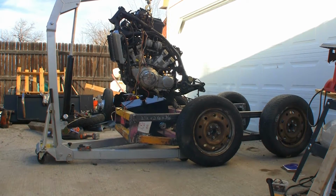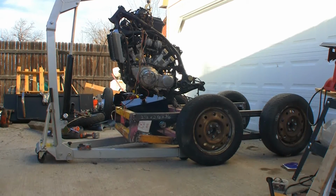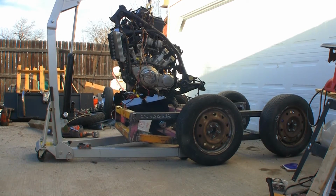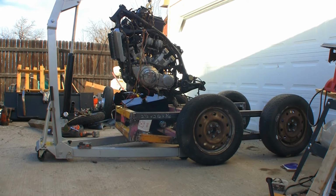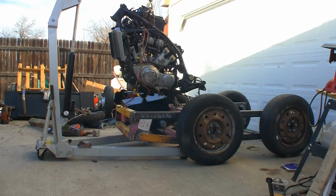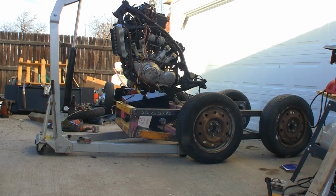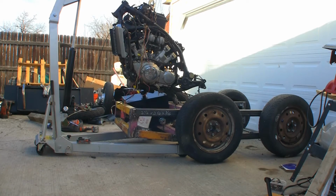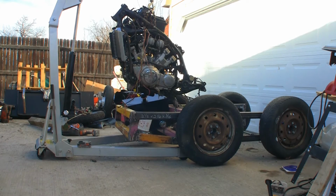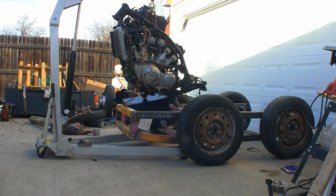It's up on wheels. Still has a long ways to go, but I got it up on wheels and started mocking up where the hydraulic tank's going to fit and where the engine's going to go. It's a Yamaha Venture Royale motorcycle engine. I'm going to run a pair of hydraulic pumps to run the hydrostatic pumps to run the wheel motors. One pump will run each side, and then another pump for the forks and bucket. And then I'll probably add a fourth pump that'll run auxiliary hydraulics for things like posthole diggers and stuff down the line. But it's starting to look like a real machine.